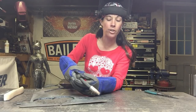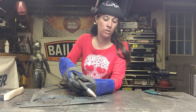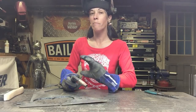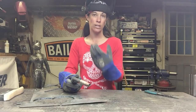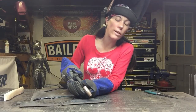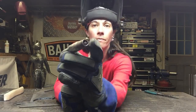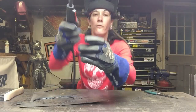You can hold the tip on the material. For MIG, that's not going to bother you. When you're TIG welding you're not allowed to touch the tungsten electrode, but with MIG you need that wire to make contact — that's what makes the circuit and gets you your weld. Anywhere from a quarter inch to half an inch is how far I hold the tip of the welder from the material.